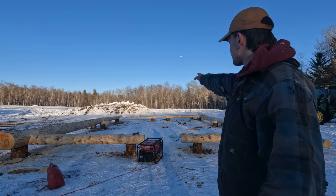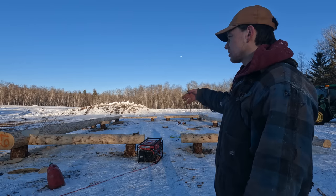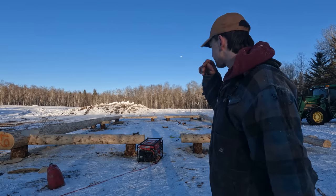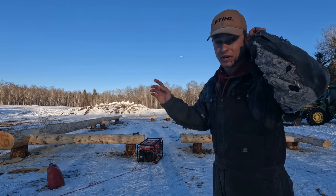But you see there, before I mess around at perfect level, I should maybe get that log rough notched and the saddles marked and swing some stuff around. And then when I'm ready for final scribe, just check it, you know. If it's got to come down an eighth, that's the perfect time to do it.